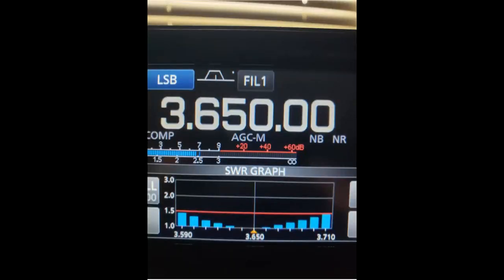So how did we do on the antenna? I cut about a foot off, but I probably need to add another several feet to bring it down to 3.550 where I was wanting to. As you can see, it's really low here, and it looks like the resonant frequency is 3.650. That's in that area, but it throws everything off in the rest of the bands when you go to 40 meters, for example. Let's look at Rig Expert.